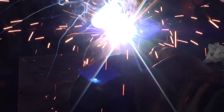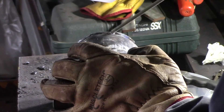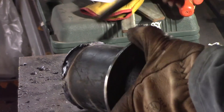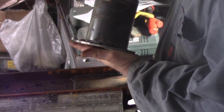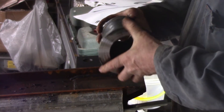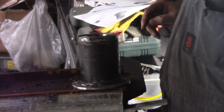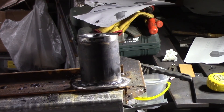I don't have one of those fancy turntables they've got for welding pipe on YouTube, so I just put it down on a flat surface — in this case that piece of three-quarter inch flat — and roll it around by hand while I weld the circumference of it. It seems to work pretty well and it turned out quite good for this job. Once I finished the welding I put it back in the lathe to make it all nice and neat. I had to work very slowly with very shallow cuts because all I had to hold it in the chuck jaws was that ring and there wasn't a very strong grip, so it took a while — that's why I decided not to record it.